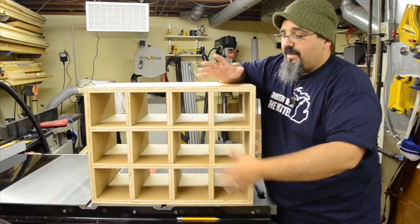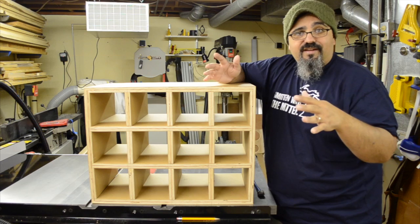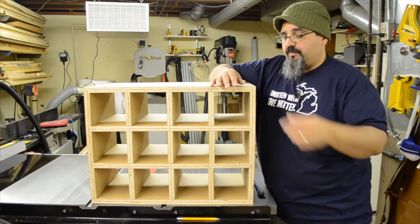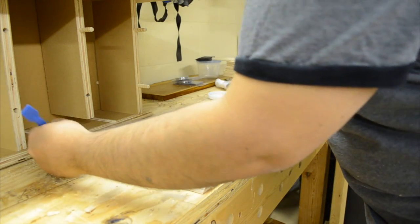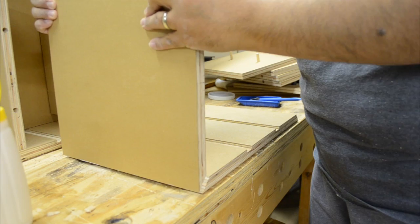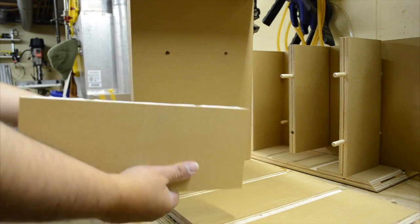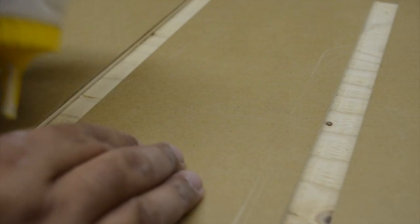All we need to do now is start assembling and gluing everything up — the horizontal dividers, all the dowels, all the vertical dividers, the biscuits, everything. The big concern would be the glue setting up faster than we can get everything together, but we had plenty of time — we just needed to work smart. We got the miter joint for the first corner set up, put glue in the slots, put that first corner together, then started putting the dowels in place and assembling. Here's a quick montage of the glue-up itself — it would have been really great to have an apprentice come in and help hold things in place.